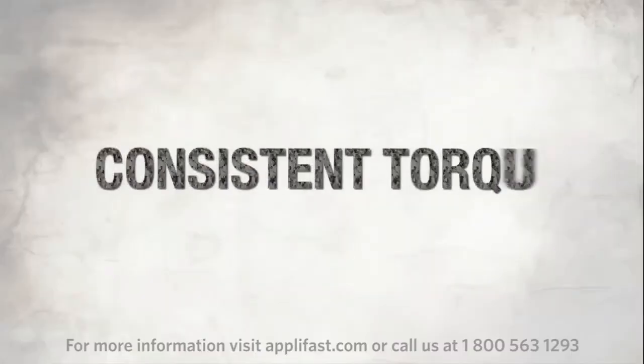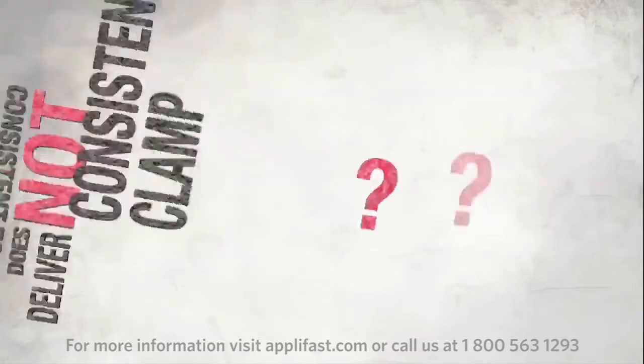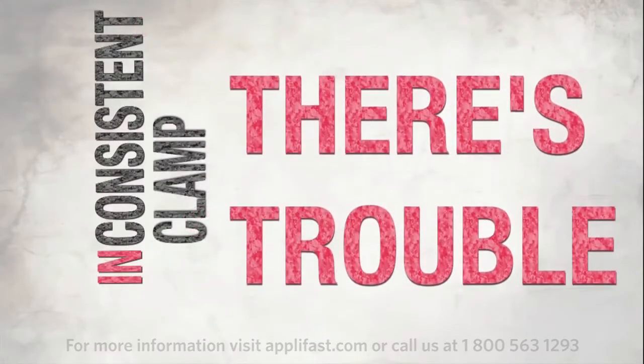Torque is not clamp. And a clamp is a measure of preload and tension in that joint, and torque is just a measure of twisting. Torque is an action. Clamp is the end result. They're two separate things. In other words, consistent torque does not deliver consistent clamp. And where there's inconsistent clamp, there's trouble.